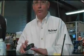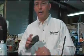Another thing folks do is use propane, and propane is a pretty reactive chemical. That's why it burns. I don't recommend putting that in any sort of oil-based finish. You never know what's going to happen between those two chemicals. One of our customers, actually several, have said that years ago they used to exhale into their containers and then put the lid on. It seems like a good idea, and they're on the right track by eliminating the oxygen, but our bodies aren't perfect, and we don't consume all the oxygen we inhale. It's the right idea, but it won't really work. That's why you can revive people using CPR, by the way.